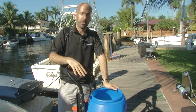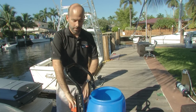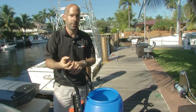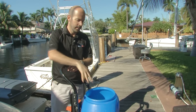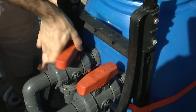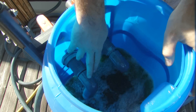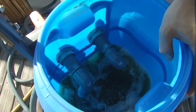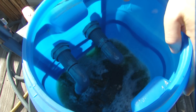Now here we are halfway through the flush, and what we're going to do is reverse the flow. The portaflush allows us to reverse the flow without having to disconnect any of the hoses — we simply turn the pump off, reverse these valves, and that's going to reverse the flow through the engine. This is an important task as it allows you to back-flush the engine. So if there's any debris that cannot be dissolved, such as an impeller blade or some other foreign material that might have gotten into the engine, it's going to end up in the bucket here. We'll first turn the pump off, swap the valves, and turn the pump back on. So now with the pump back on, you can see that previously we were discharging on this side, but now we're discharging on this side. And you can immediately see some debris floating, which shows that back-flushing was a good idea.